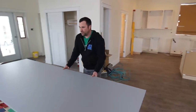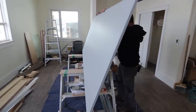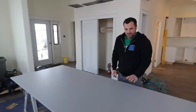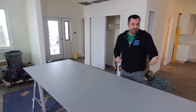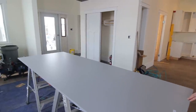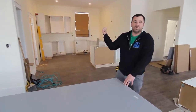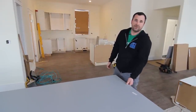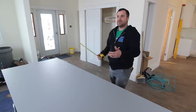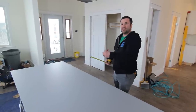I've put cardboard on my sawhorse so I don't scratch the panel. This side I'd call the inside because it has a sticker, but this side does look nicer. So I'll put the nice side toward the tile — toward the most exposed part — and the scuffed-up side will go on the inside where the fridge goes. If you have an oversized item on the table saw and can't set the fence to 25 and 3/8, you flip it so you cut the narrow side against the fence.